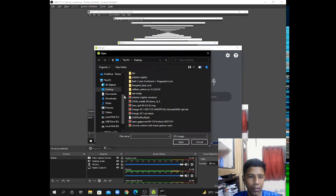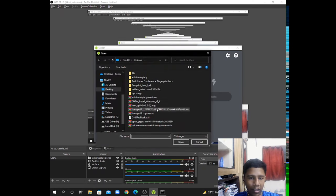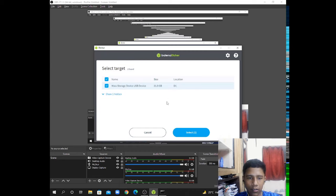Here you can use either Balena Etcher or Raspberry Pi Imager. I'm going to use Balena Etcher because I'm comfortable with it. First I'm going to choose flash from file and select the file. Once it's done, you can choose your storage device and select flash. The links to these files will be given in the description below. According to your net speed, it will take about 6 to 7 minutes to flash and verify completely.